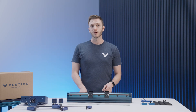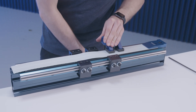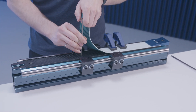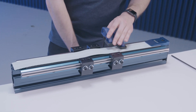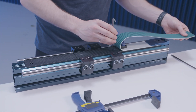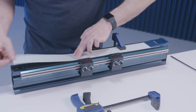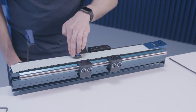If you are assembling a system that is smaller than two meters in length, you can use the previously shown method to install the rest of your rack segments. If your system is larger than two meters, you should use the following procedure to install the rest of the rack segments using two clamps throughout the entire process. With this method, you install the new rack segment, lay the belt across the junction, and clamp it on either side. Once clamped, you can then tighten the furthest fastener. With the new segment partially fixed, remove the second clamp and tighten the secondary fasteners. From here, you can add your next rack segment and repeat the previous steps, making sure to leapfrog the clamps so that the belt is kept under a slight amount of tension at all times.